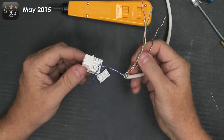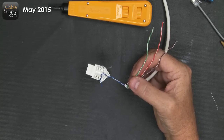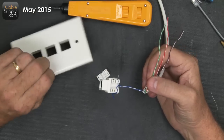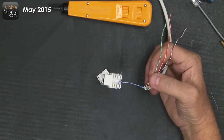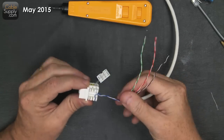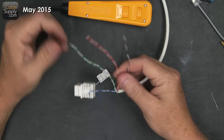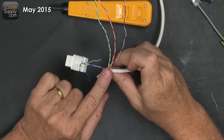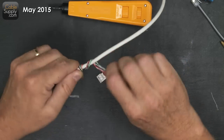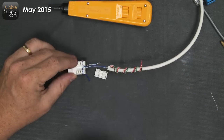If you have a three-port or four-port jack, the other end of this cable might go to a 66 block — that's how you do voice. You can put another jack on the second pair and another on the third pair. Rather than cutting off the unused pairs, just twist them up and save them. If you need an extra jack at the same location later, the wire is already there — no reason to cut it off.